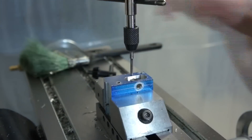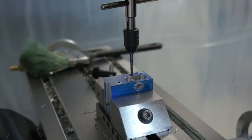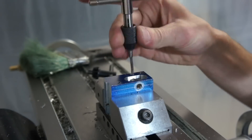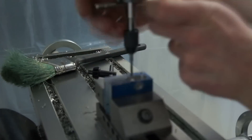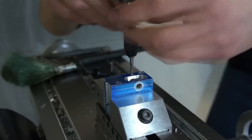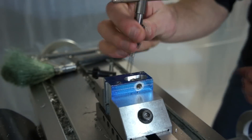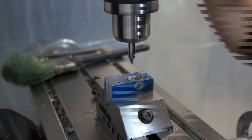When tapping on this mill, I find that if I open up the little teeth on the Jacob's chuck just to go over the top of my tap — not to grip it, but just to steady it — I put the tip of the tap in the hole and keep the jaws over the top of the tap, and it keeps everything concentric. I do have a little brass pin that will also index into the top of the tap, but it's easier to do it this way. Once all the tapping was finished I brought the center drill back down just to clean up the little burr that was left.